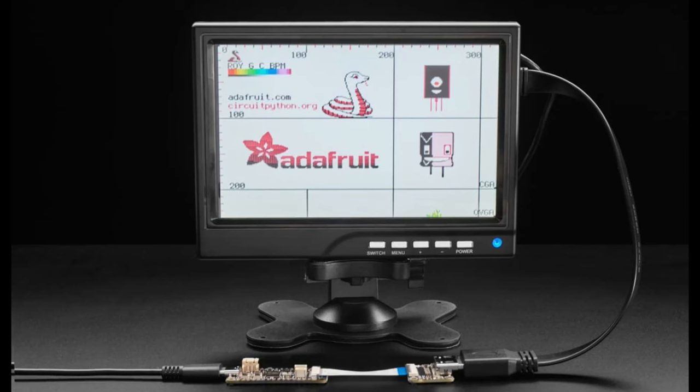So in this case, it's a CircuitPython demo. We're displaying 240 by 320 pixels, 16-bit color, and they're pixel doubled. We do that so that the output is 640 by 480, which is the minimum legal DVI HDMI resolution. You can also do true 640 by 480, but you're only going to get 8-bit or 4-bit color because you just don't have enough RAM on the RP2350. Maybe with PSRAM, we'll be able to get more colors and higher resolution.